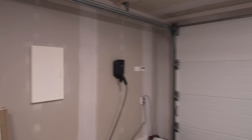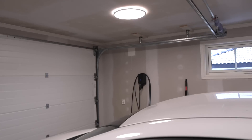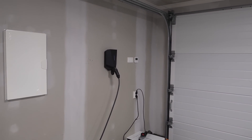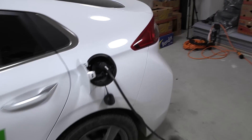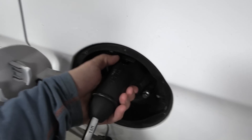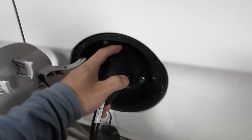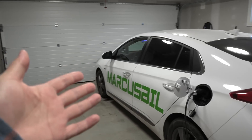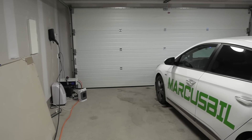This was the dilemma. When I wanted to install charging stations here, the electrician asked how many amps I wanted. I figured most cars nowadays have an 11 kW onboard charger, so 16 amp would have been enough with three-phase 400V TN. This cable is from Metron — I went for a 10-meter cable, long enough to stretch over to cars with the charge port on the right side, not the left side. The box also has a Tesla remote release button. Since this car doesn't have three-phase, we only get 3 kW.